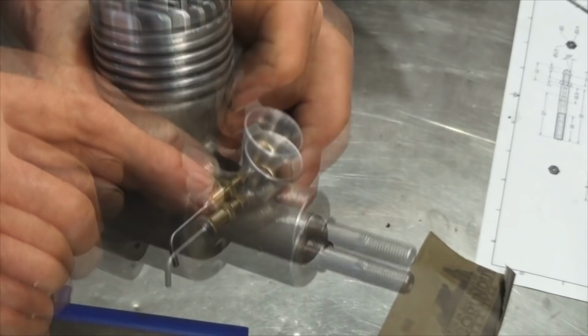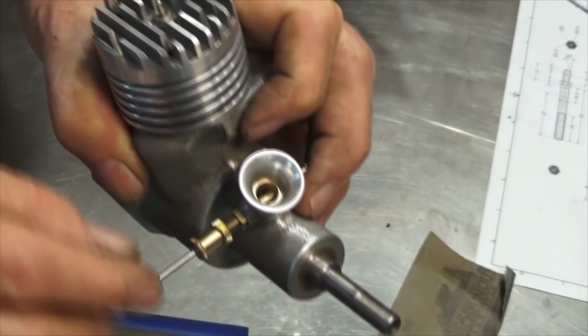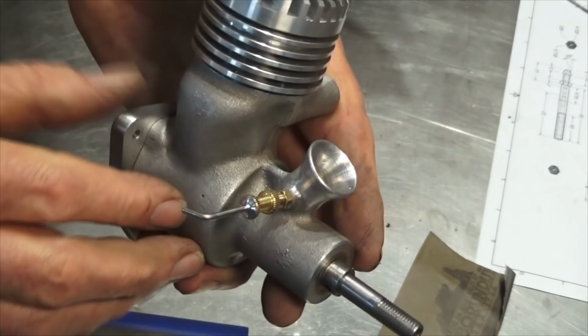Also, we need to drill the cross hole in the center of the spray bar so it's centered on the venturi. That's a very, very small hole. It's going to need some very careful setting up. And I also need to make the three hex headed bolts that hold the bulkhead mount onto the test stand. So all of that's going to come up in the next video, and then we'll have a look at breaking the engine down and doing a lot of the cleaning and the surface finishing on all of the parts.